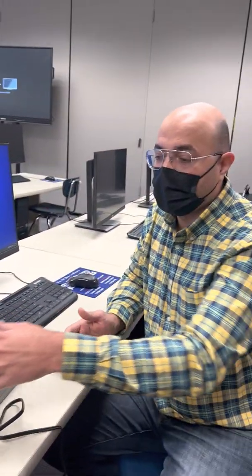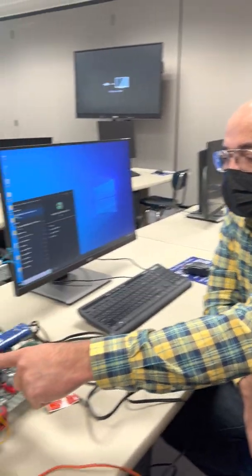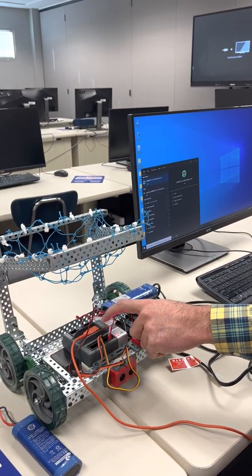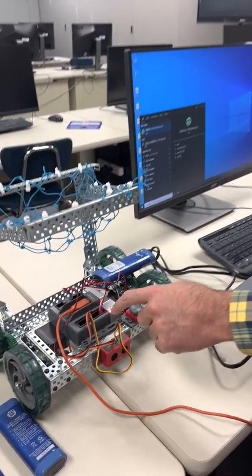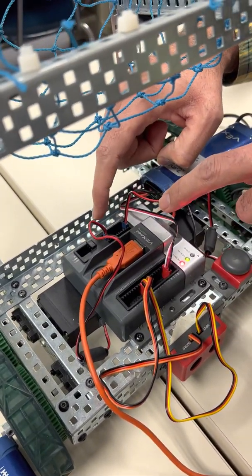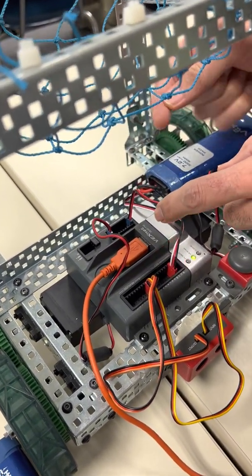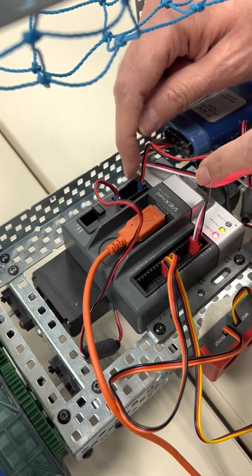The plan is to code this robot. You can see it comes with different components. The VEX Cortex main brain has inputs and outputs. On the output side, there are motors numbered one through ten. Motors one and ten use two-pin connectors; any other motors use three pins and require an extension.